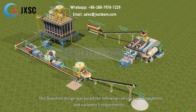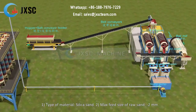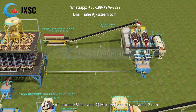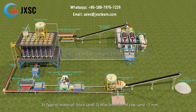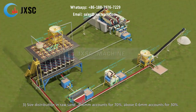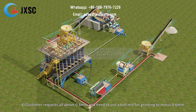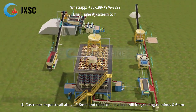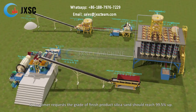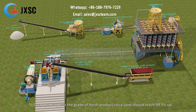This flowchart design was based on the following raw silica sand conditions and customers' requirements. 1. Type of material, silica sand. 2. Max feed size of raw sand, 2 mm. 3. Size distribution in raw sand, minus 0.6 mm accounts for 70%, above 0.6 mm accounts for 30%. 4. Customer requests all above 0.6 mm and needs to use a ball mill for grinding to minus 0.6 mm. 5. Customer requests the grade of finished product silica sand should reach 99.5% up.